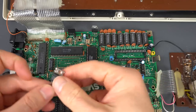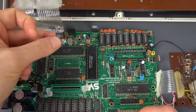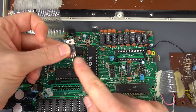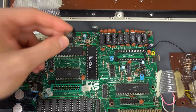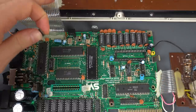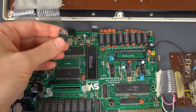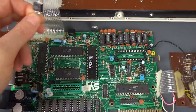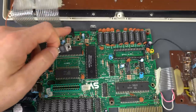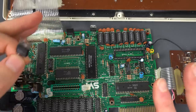As I'm working on the board, the 7805 voltage regulator kept being knocked around because it had the huge heat dissipator on it, and eventually it just cracked. So I ended up removing it and replacing it with a Traco Power modern voltage regulator, so it doesn't generate any heat and doesn't need any heat sink. This should be much better.